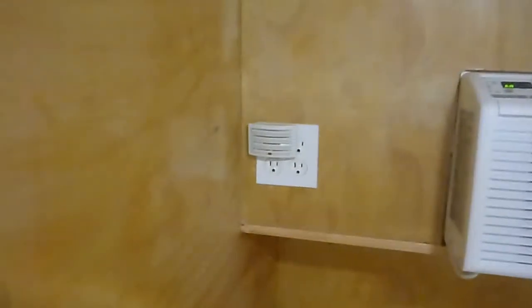I've got a little 110 outlet right there. I'm not done fixing the inside — there were some imperfections I didn't like, and it'd be a little bit rough. So I'm going to put one more coat of polyurethane on the inside, then hit it with 220 grit — just knock it off. You can see when I pick up the dust and touch here, it just sticks. That rough part just picks the dust right up. Once I get done sanding it with 220 and clean it, I'll go back and put a really super thin coat with a really high-end brush — I'm using the white China bristle brushes.